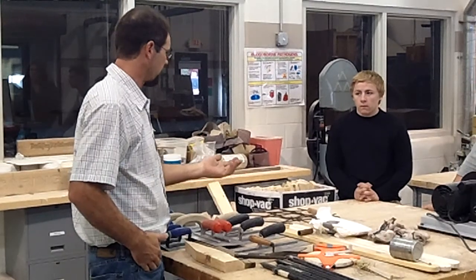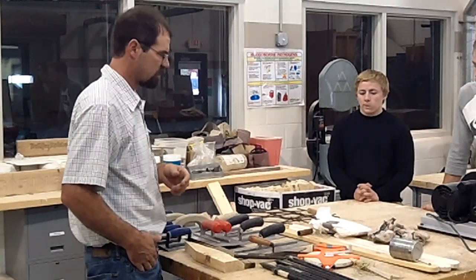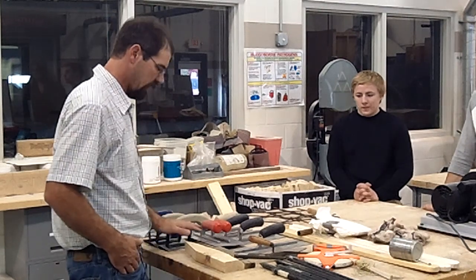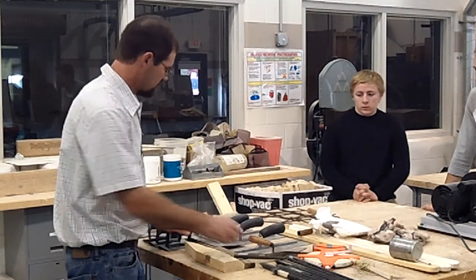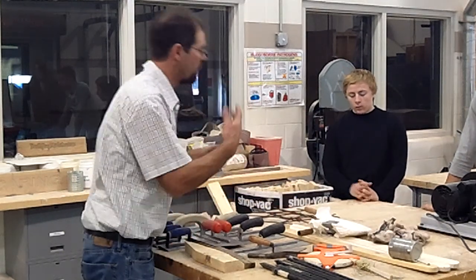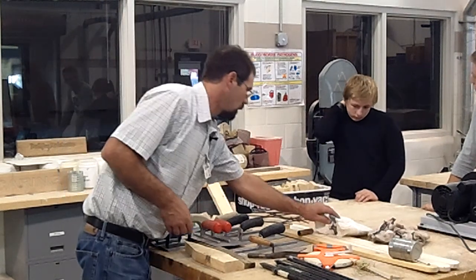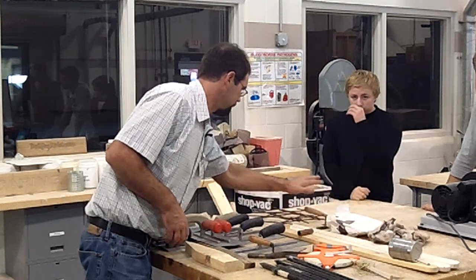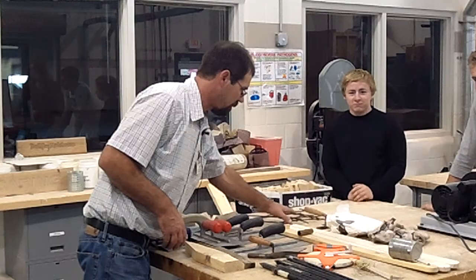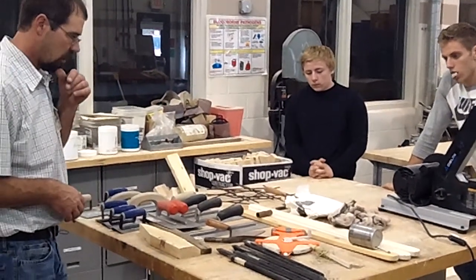And it's a great idea, especially for outside pours, to have that stuff put in there. And it don't cost you much more a yard to do that. So that's the 3 methods of strengthening it up, other than ordering your concrete with more bag mix of cement. It's wire mesh, fiber mesh, or rebar, or re-rod.